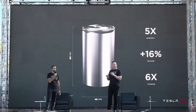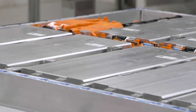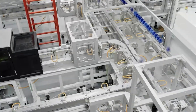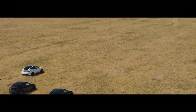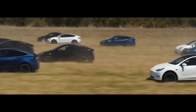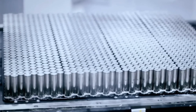The new battery cell, like previous cells, is cylindrical in shape and uses lithium-ion chemistry, but that's where the similarities end. The most major modification occurs inside the bigger cell canister: removing the tabs that serve as positive and negative connection points between the anode and cathode and the battery case. One of the most significant advantages of removing tabs is an increase in production speed, due to the elimination of the start/stop process that tabs require for installation.